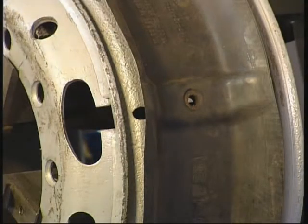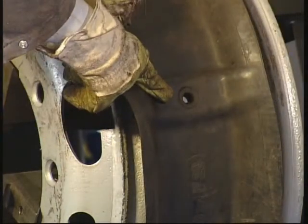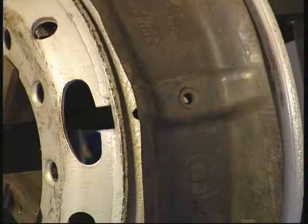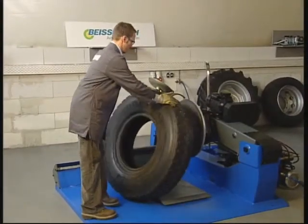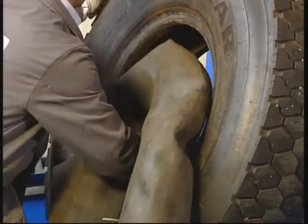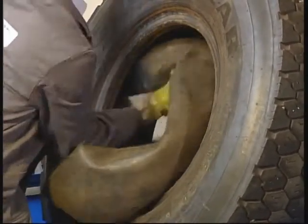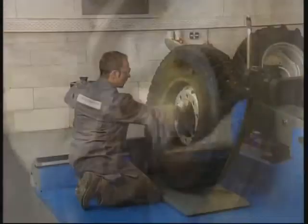Mounting of locking ring tires. While pushing the tire on the rim, mind the position of the valve and the tube protection to avoid damage, and keep the procedure as simple as possible. Insert the tube and inflate it slightly. Move the tire to the rim and center it carefully.